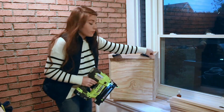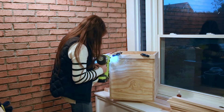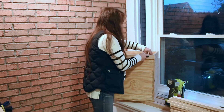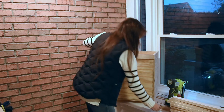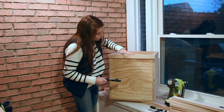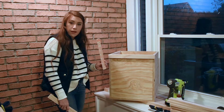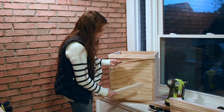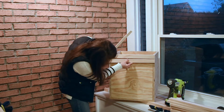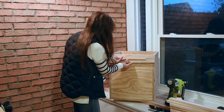I did two at the top, one at the bottom, one at the top and then bottom at the top. Once you undo your clamps, check if you need any nails in the middle — we didn't need any in ours. I have some paint stir sticks I'm going to use as spacers because I don't want the slats tight against each other; I want there to be a small space.